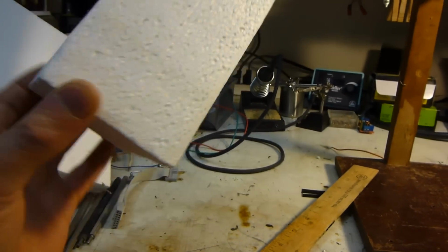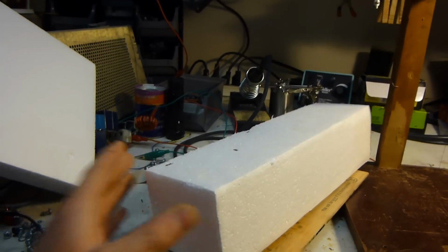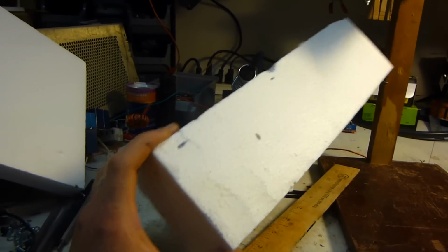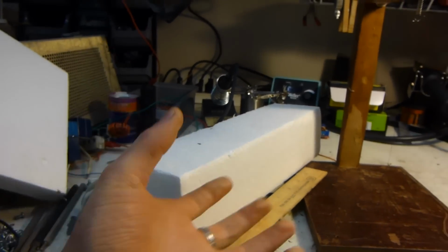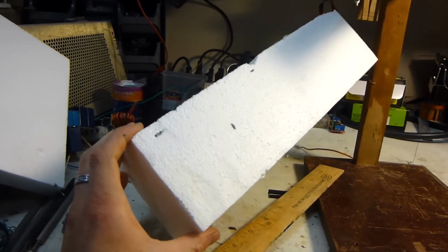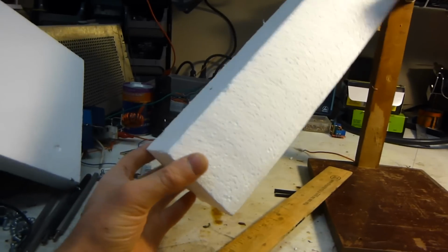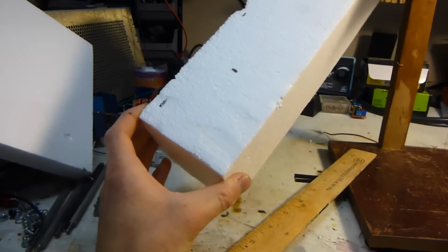I mean, I'm going to do green sand. I have the kitty litter available. I just have to get around to doing it. It just takes more work because I have to make a mold, or a form, of the part you want to make an imprint of in the sand. That takes a lot of work. With this, you basically just carve it out of styrofoam, bury it in sand, and pour your aluminum in. It's really easy. That's why I do it.